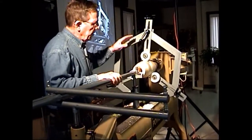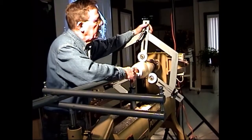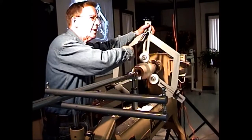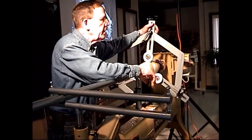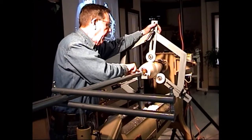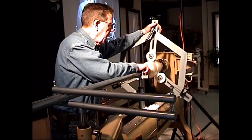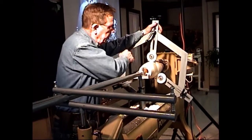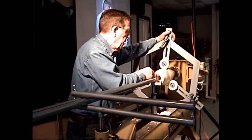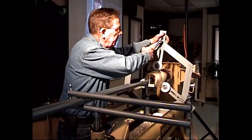You can go straight in like that, or you can keep making cuts across. This cutter will actually cut both directions, coming and going, so that's advantageous. The angle at which you put it here can be changed. This is a little bit sharp. If I wanted to really go in through this fast, I'd probably take this about 10 more degrees toward the front, and then I could go back and forth.